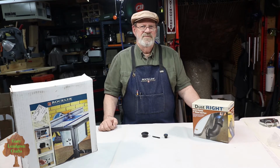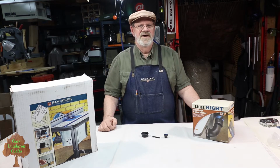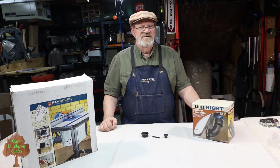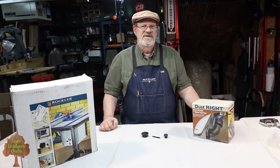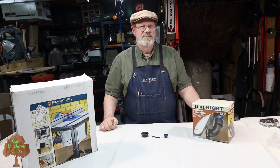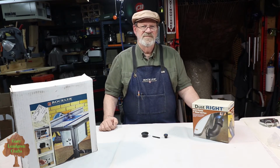Now, the router table in the wing of my table saw is one I installed in 2017, and I made a video on that. Now it's time for some updates, and I'll put a link below to the video on the router table installed in the wing of my table saw on my Ridgid R4512. While I have a fence that I use with my router table, it has an adjustable opening and a vacuum port, but it still doesn't capture all the dust, and sometimes none, depending on the routing process that I'm doing. So here I'm going to install a dust bucket to capture as much of the dust as I can.